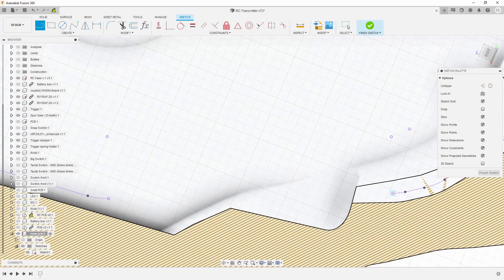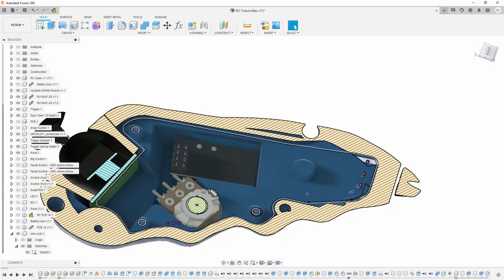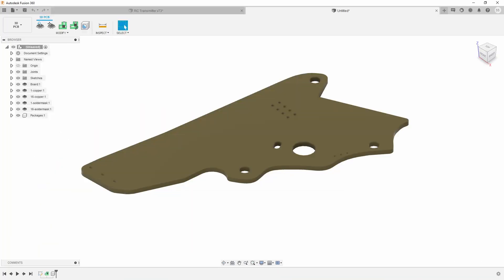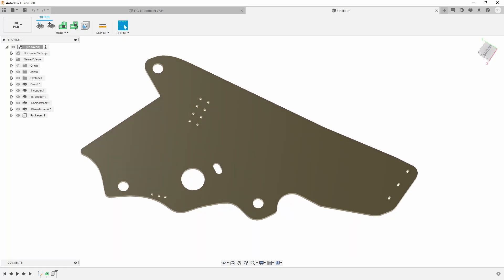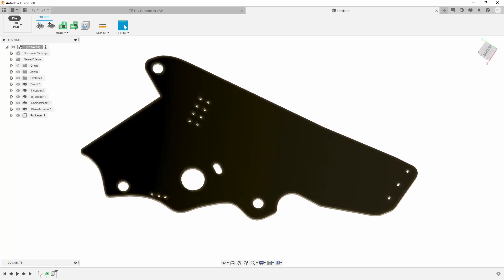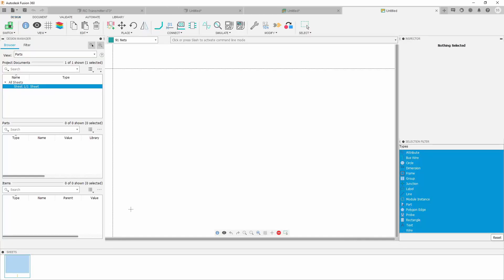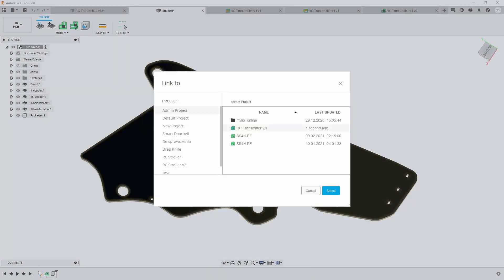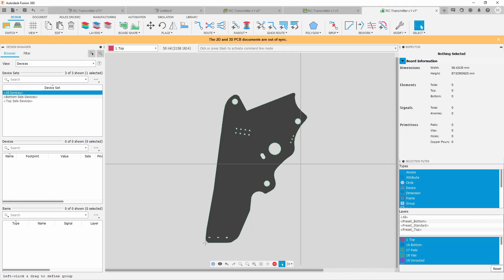The part I love Fusion 360 for so much: in the project I got to the stage where I needed to place the PCB. I didn't have to define the shape elsewhere and then redraw it here — I could do the exact opposite. I drew the outline I needed here and then generated a PCB model with a couple of mouse clicks. I could create a new electronic design and link the generated PCB shape with the actual PCB. From now on all the PCB changes will be visible on the 3D model on the fly. And that's exactly why Fusion is called Fusion.